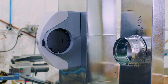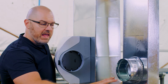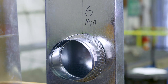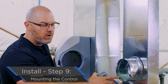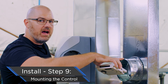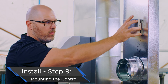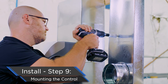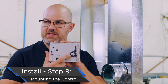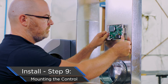Our humidifier is now successfully installed on the ductwork. It's time to hook it up to a control. Here we're simulating the return plenum — this is where your bypass pipe would come from your evaporative humidifier. To install the control, the first and most important step is that we need to be a minimum of six inches above the top of the bypass. We took a tape measure, measured up six inches, and drew a flat line so we know right where to install the control. We'll need to cut into the ductwork on the return side to make a space for our sensor — a three-quarter-inch hole so the sensor can be placed into the stream of air. This foam gasket will seal it so we don't have interference from outside air.